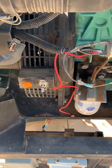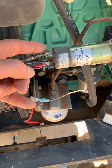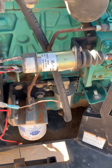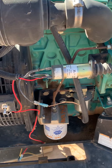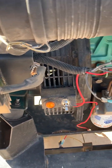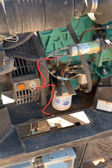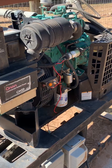In order for the engine to start, the solenoid needs to be pulled back to allow fuel availability — by default it cuts off the fuel and stops the engine. This unit had so many problems that they simply put in a bypass and wired it directly to 12 volts. The accessory also runs down to the electric fuel pump here — a low-pressure pump that circulates the fuel. The reason this thing most often fails to stay contacted is a fault signal or no signal at all in the oil field. We've seen people come to these generators and just use a bungee to hold the solenoid back so it'll keep running — that'll get you going in an emergency, but if the engine is overheating or has a fault it won't shut it down and you'll destroy it.